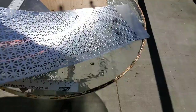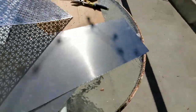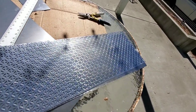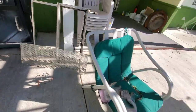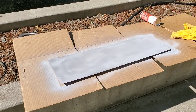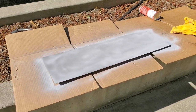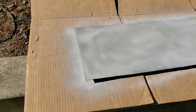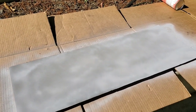I'm going to go ahead and prime the back, and we're going to be putting that with the white that matches the rig. This will overlay the top and give a really nice effect when sitting in the frame. The frame has to be cleaned up too. When I prime, I always put down a base tack coat first. I don't worry about overcoating every bit of it because that way you create runs in your paint job. I'm also making sure to get the edges for maximum protection. I'm going to let that dry, flip it over, do the other side, and then a second coat on both sides.